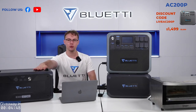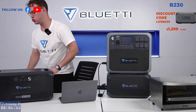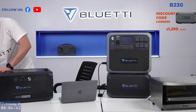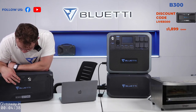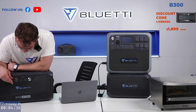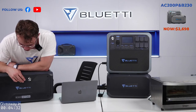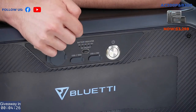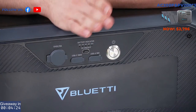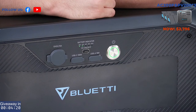So guys, next, what is next? For the B300 expansion battery, we have some outputs here. I would actually love to show them to you guys. The outputs are all here in front: a 12 volts, 10 amps car cigarette lighter, a USB type C port at 100 watts, a USB type A port at 18 watts, the button to turn on and off, and the battery indicator. It shows you the battery percentage. To turn on, just click this button. Right now it's on.